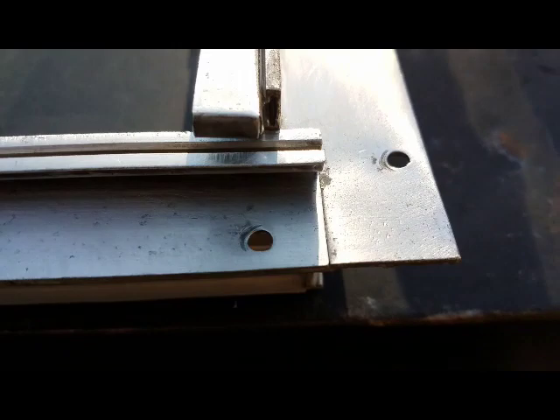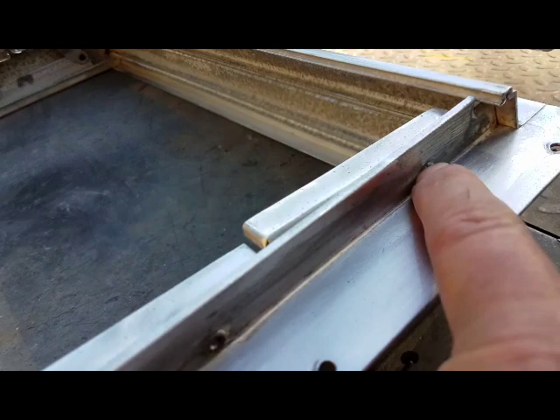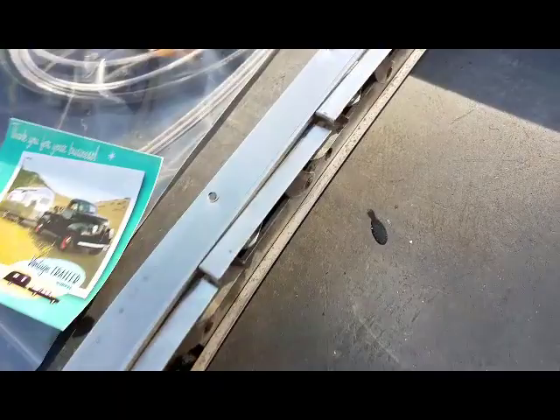I got sucked into one more round with that wheel cleaner. I hit it with the wire brush and did some more with the roll lock, some more clean, and some more Scotch-Brite. The problem spots are here around these rivets — you can't really get the paint with the die grinder or anything, so you kind of have to do that manually. In this corner you can see there's some paint there still. That's as clean as you're going to get.